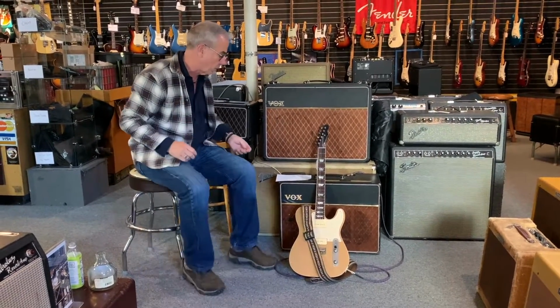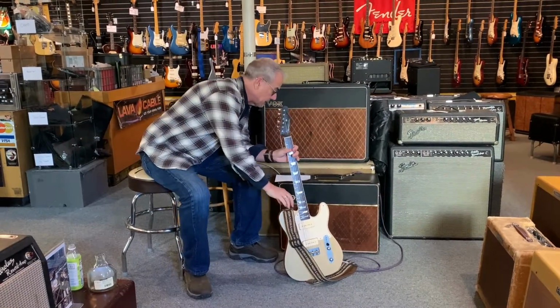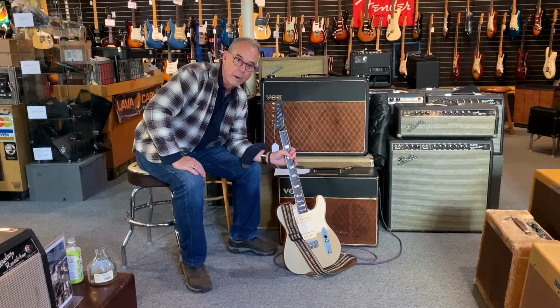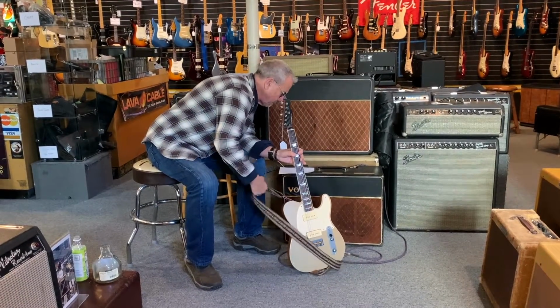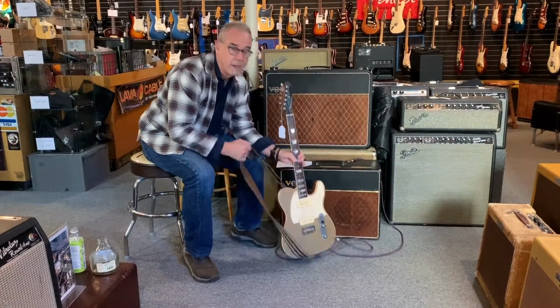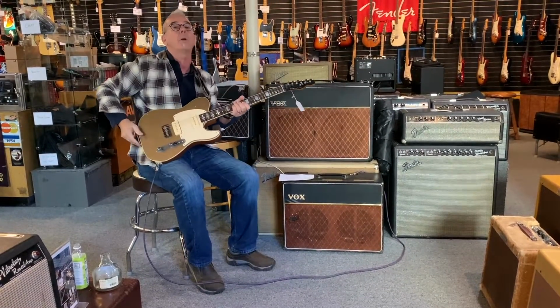And the biggest cause for an amp that starts sounding fatigued, or an amp that just doesn't sound kind of blah, is power tubes. Power tubes need to be replaced, and they should be biased too. An over-biased amp will sound kind of dirty at any level. So if it's over-biased, it doesn't have enough voltage going into it. And if it's under-biased, it's going to lack a lot of punch. So you want somebody like us to do the biasing for you on your amplifier.